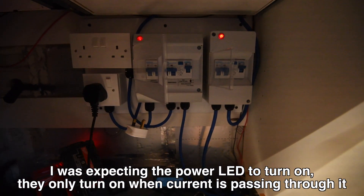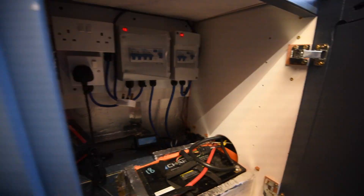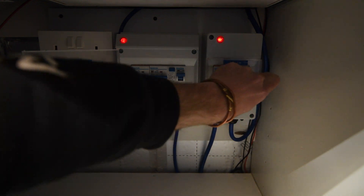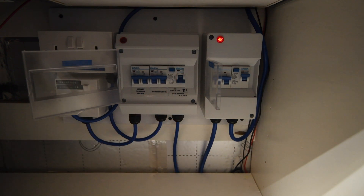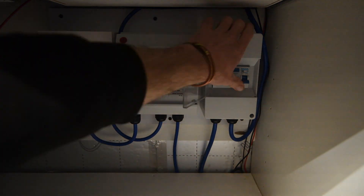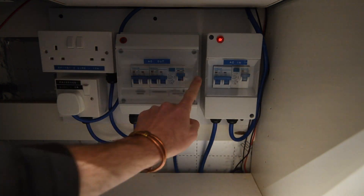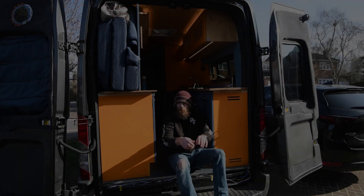I think this shouldn't do anything because the controller is overriding it — we'll just hit the wall one. Got a green light, so next I'm going to flip the switch in here and then maybe these and maybe that. Hmm, nothing. Well, nothing here — I'm not quite sure why. Oh, turns out I forgot to press the actual buttons to turn it on — they were in the off position. Currently charging. Since it's all set up I thought we'd actually do a test to show that the RCDs are working. If I press the test button it should flip that down — there we go, cut the power. And if I do the same for the AC in, it should do the same and cut the power for both of them, and then when it sorts out the internal relay it will flick on in a second. Cool — RCDs work, and it's always good to test them periodically.